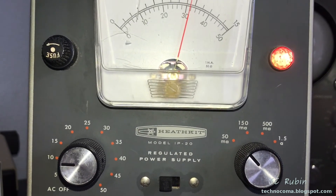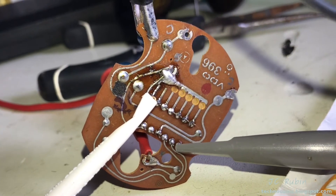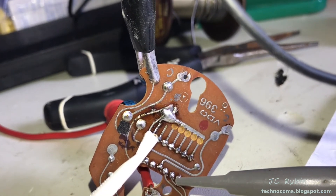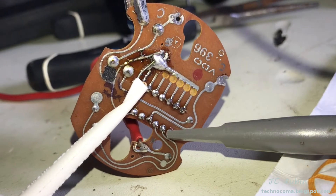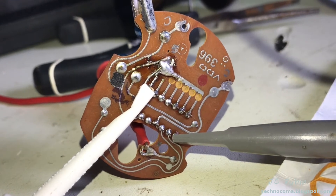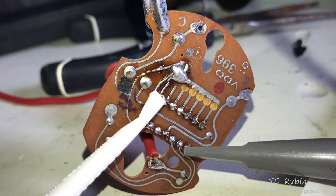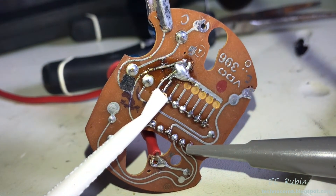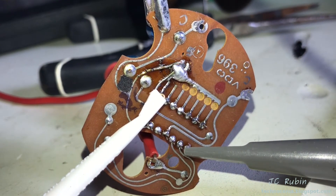I've set the current limiting for as low as possible — 50 milliamps, tuned all the way down as low as I could go. Connections are red positive with white negative. I have negative common off of the oscilloscope on black, and the oscilloscope is also connected to pin 7 or pin 8, which is the test pin representing one quarter of the oscillating frequency. For this test there is no load — nothing's connected to it, all I have connected is the test port. There's no coil on this, which will obviously affect the current somewhat, but that's not what we're shooting for right now.